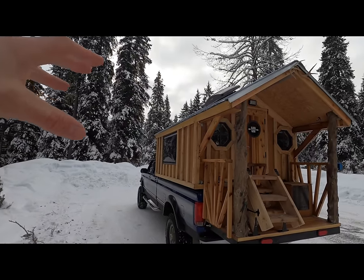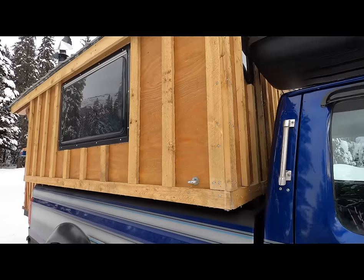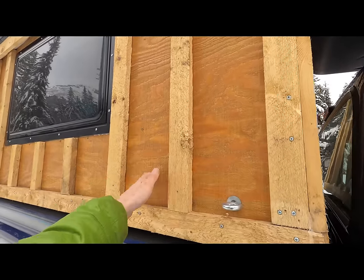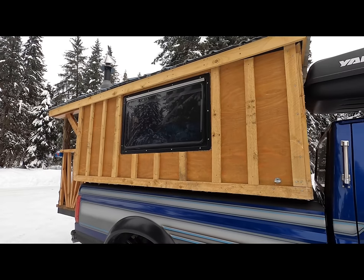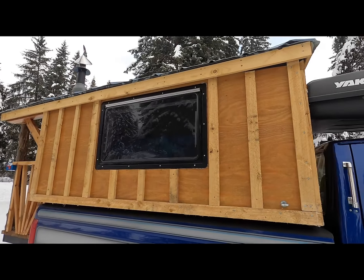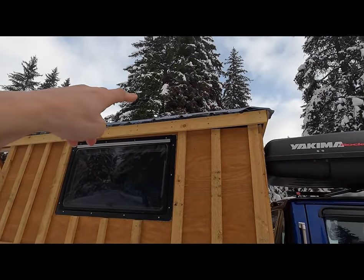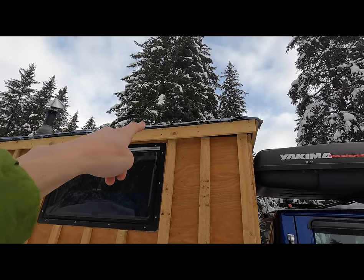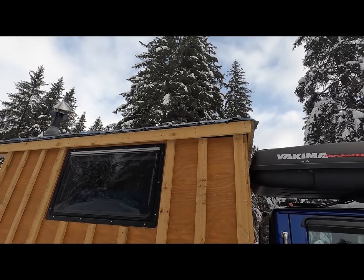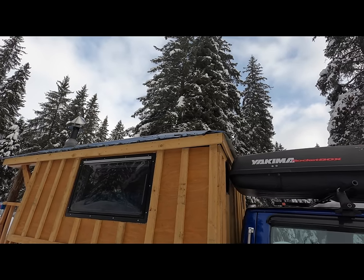The pitched roof also sheds snow off, so you don't have to worry about a heavy snow load collapsing the roof if you leave for a couple months. The outside of the camper under the plywood is wrapped with Tyvek just like a typical house — it's waterproof and breathable so it helps condensation escape. The roof has two layers of water protection: first the metal roof that keeps the water off, and under that you've got Grace Ice and Water Shield — a super waterproof, rubberized membrane. So it's got two layers of protection.